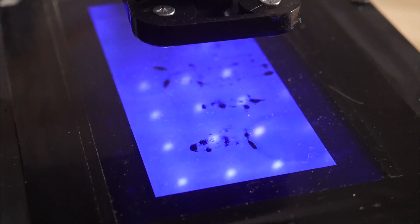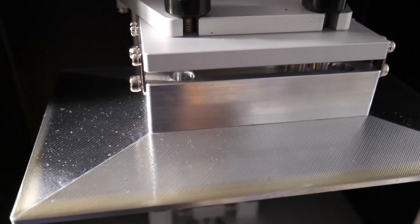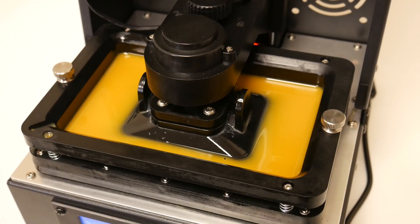Alternately, after every print, you'll definitely want to also inspect your build plate to make sure there are no rough spots or burrs from where you might have been rough in taking a print off the plate. If you did have a burr, just simply sand it down with a fine grit of sandpaper, and make a note to yourself to never be that rough with your build plate. After that, you'll want to re-level your plate, because when you've handled your plate that much, the bed level can change slightly, which can affect and potentially damage your FEP sheet if it's too close, or cause adhesion issues if it's too far away. So it doesn't hurt to re-level your plate after every single print as a normal maintenance practice.